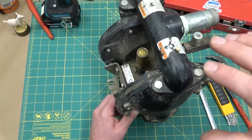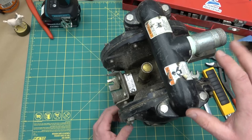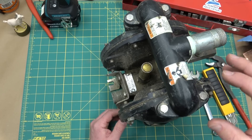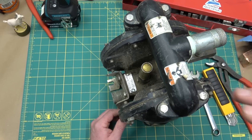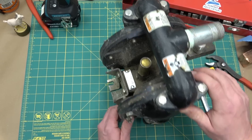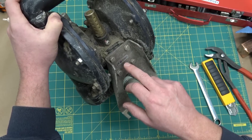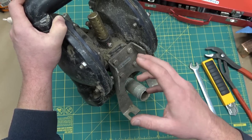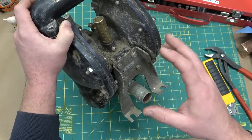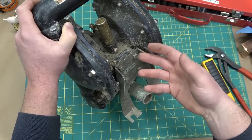They go through an incredible amount of air. This is one-to-one — this is rated at 150 liters per minute, however many gallons that is, and that's how much air you're going to go through. That is a hell of a lot of air at 120 PSI in a very small form factor. These are also rated for explosive atmospheres and for pumping flammable fluids like waste oil, engine oil, diesel fuel, all that sort of stuff. Because the pumping elements are separate and it's running on air, we don't have to worry about it exploding.